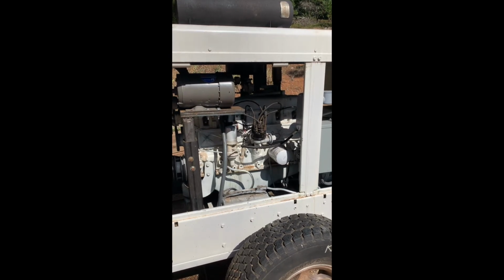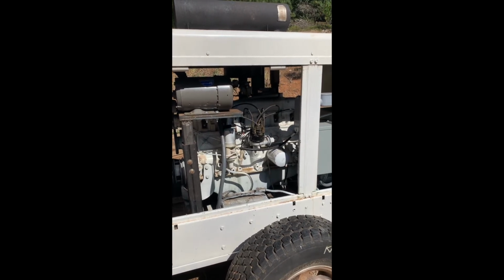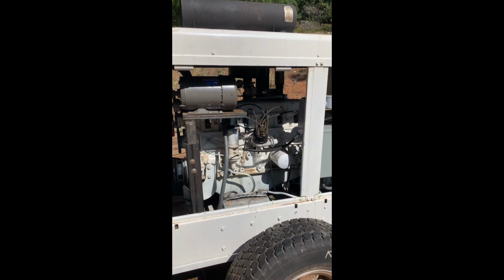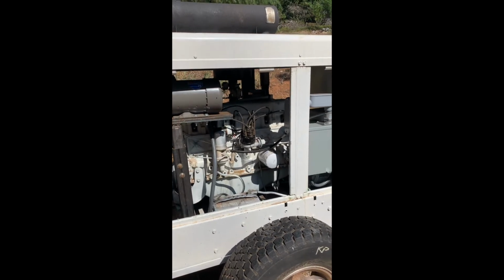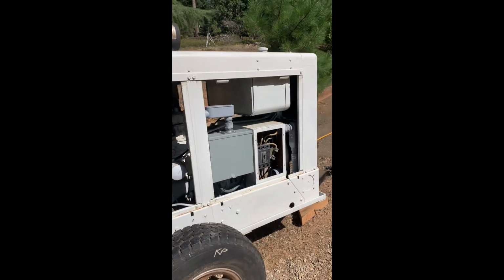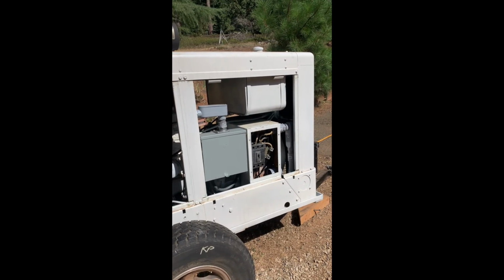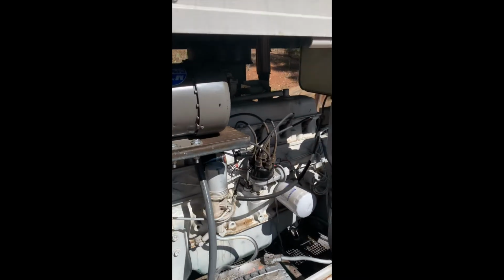The generator head itself has a fan as well. It's much quieter than the engine fan, cooling fan running at full tilt. I had a spare VFD, spare 1 horse electric motor. I had some flat stock plate steel, and I had some square tubing, and obviously it had nuts and bolts. So I decided I would go ahead and try to put a variable speed cooling fan on this unit and see what happened. How much would it quiet down, and would it keep the system cool?